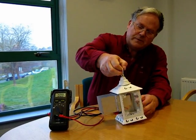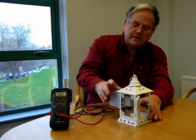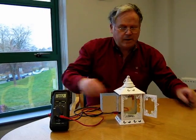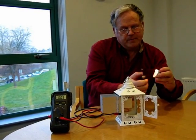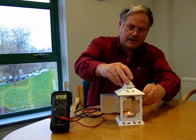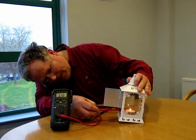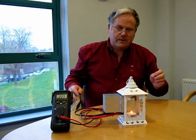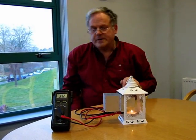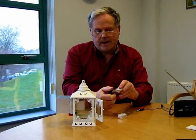If this is placed in a lamp — this lamp was obtained as a Moroccan-style standard lamp — and the heat generator, which will be described in a few minutes, is bolted onto the side here. We then place a lighted candle into the generator and connect up a voltmeter to the device. As the heat flows from the hot inner surface to the outer surface, a voltage is generated. To get more power out of these machines, two candles can be used.